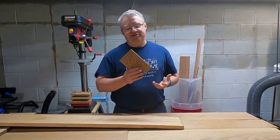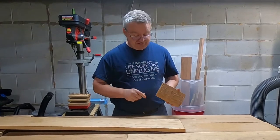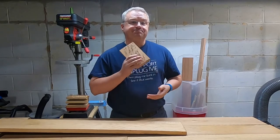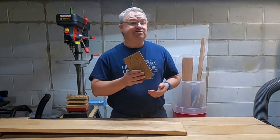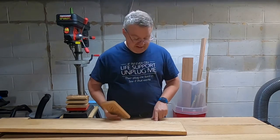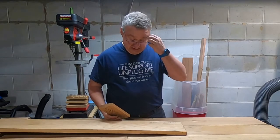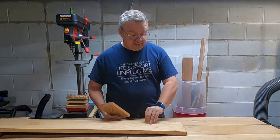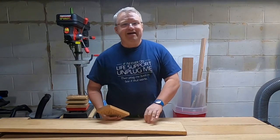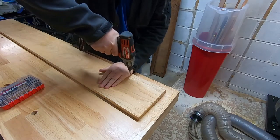So keeping this was sort of me verifying myself, but by having this, I was able to verify that yes, that right there is the broken nail. So this told me, yes, there's a broken nail still in there somewhere, and this helps to verify that we found where that's at. So now, if I can get that nail out, then we should be golden going forward. I don't think there were any other ones, but I hope not, because everything's gone through. At this point, if there is one, I've chewed my blades up. This is the smallest drill bit I have.